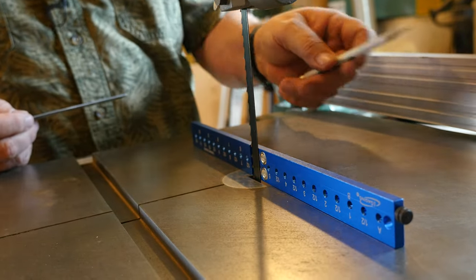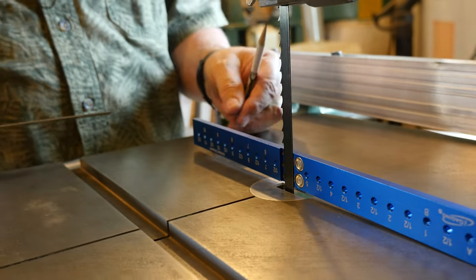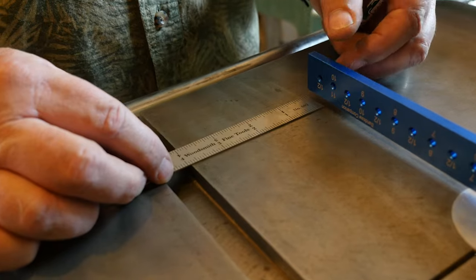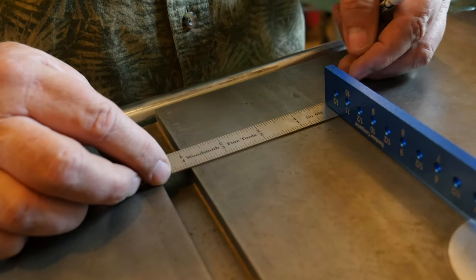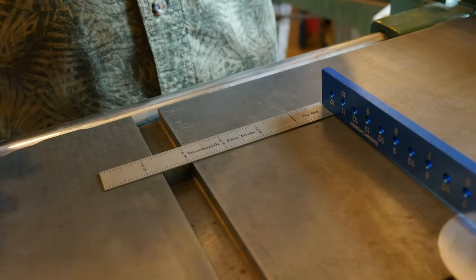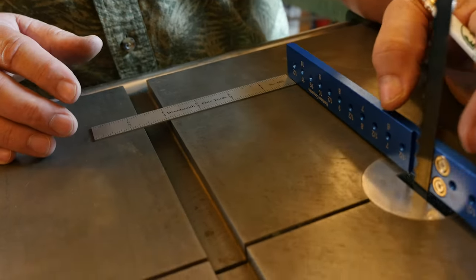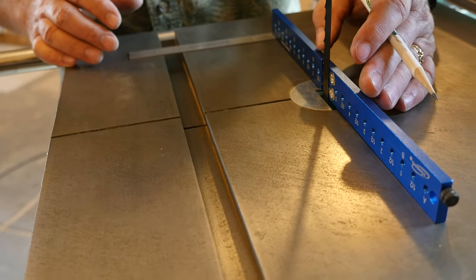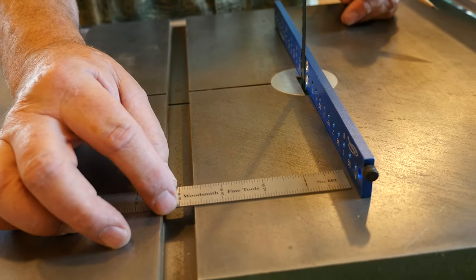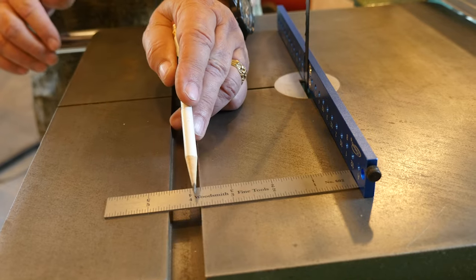Now that the bar is in place and settled, I can raise it just slightly and then let it settle. I'm now going to go ahead and measure in inches. I'm going to put this down and let it settle again. We're finding that right there we are right about three and fifteen-sixteenths, just slightly under. Now I'm going to go the other side — I'll lower this down on the table a little bit and settle it. Remember the other one was three and fifteen-sixteenths, so I'm just going to come right up against there. And notice that I am about an eighth off.